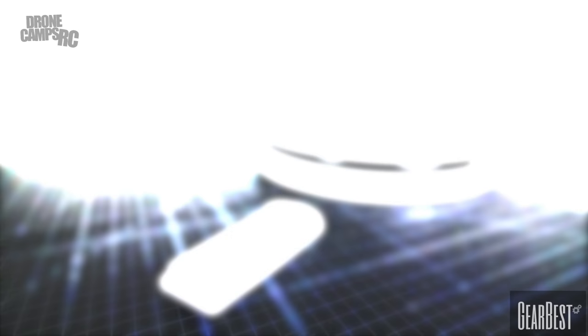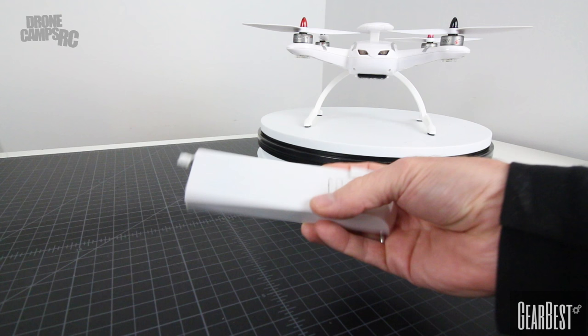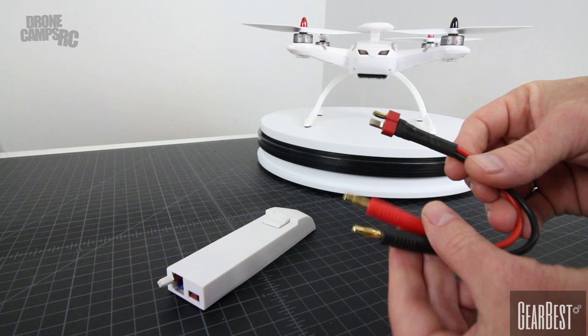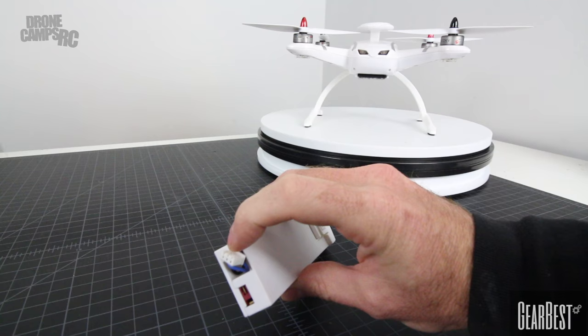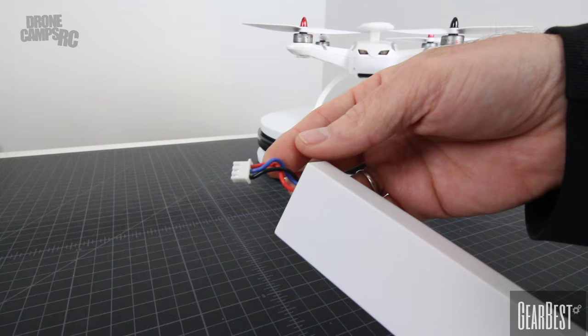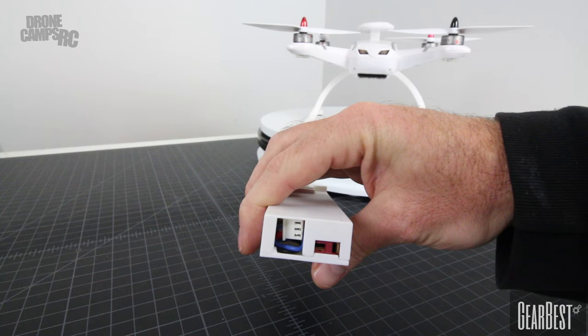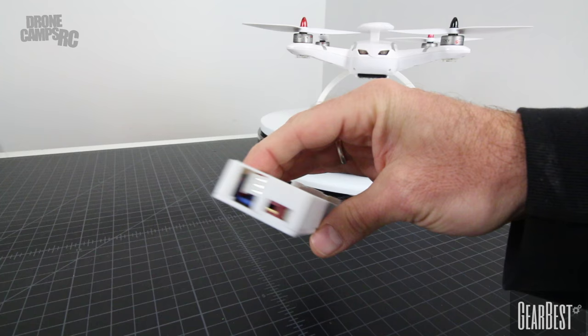I like to wear the neck strap when I'm out in the field. Now let's take a look at the battery. It's a 7.4-volt, two-cell, 2200 milliamp battery, and it does have a Dean's connector. You can charge this from a standalone charger — if you have a little connector that will connect to your charger, you can charge it on your regular charger. Or you can use this balance lead here — it's kind of tucked away inside this little hole — which plugs into the charger that comes along with your drone. When you're done, you can tuck it back in that hole when you're ready to fly. Make sure the cables are nice and neatly tucked in there. It's pretty cool that this battery is chargeable with the included battery charger or your standalone charger.